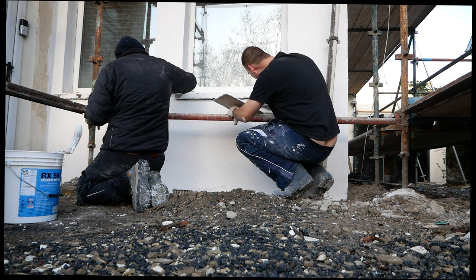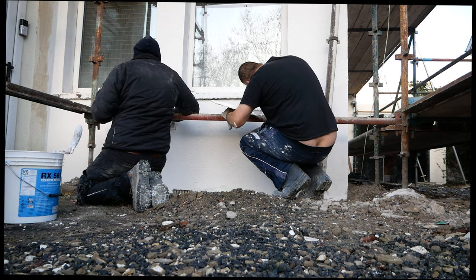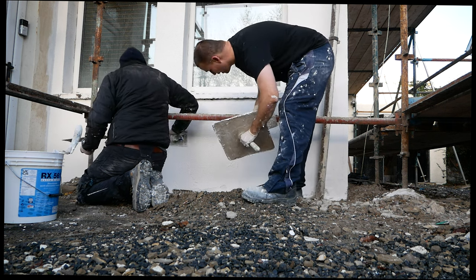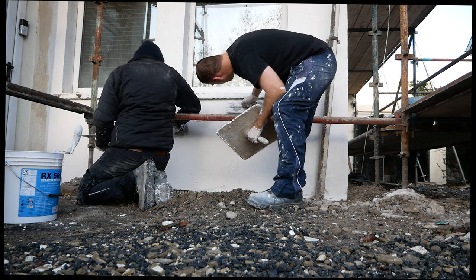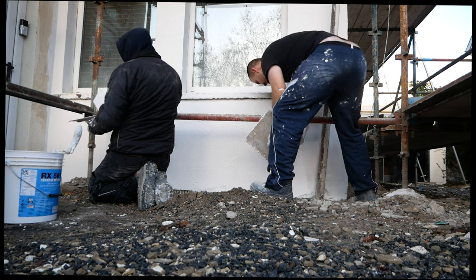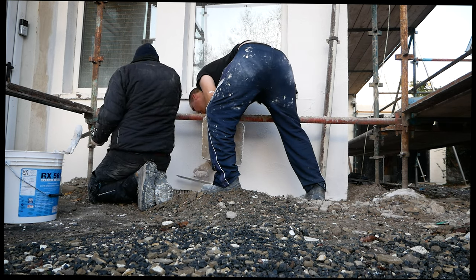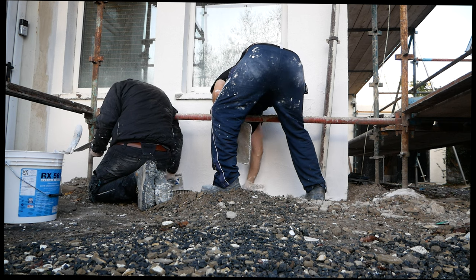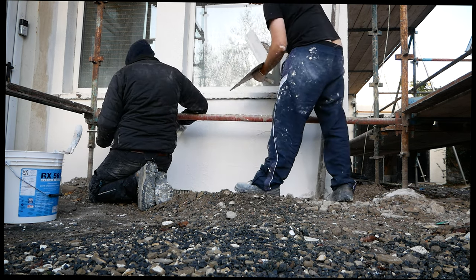On this one it did set but the bottom six inches still stayed soft the next day, and there was rain coming in and I was very panicky — but I came and checked on it again and it was fully solid, so I was happy. You would not want a big downpour hitting an acrylic wall you just finished. Basically how it goes: prime it well a couple of days before, make sure your primer is completely done, then apply it with clean tools, clean scooper, and mix up the gear before you start. Give it a good drill.